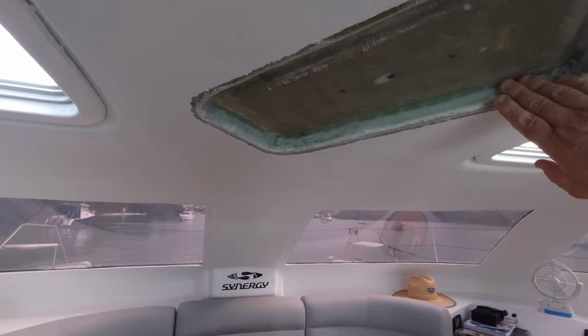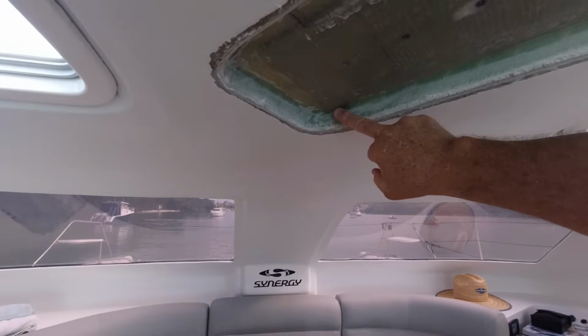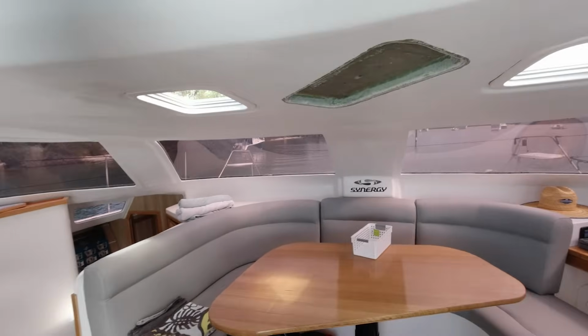I only did that an hour ago, and that's how hot it is today. We have basically got that set and sanded within an hour. That is the beauty of working with vinyl ester. You can work with it and it's off almost as quick as you lay it.